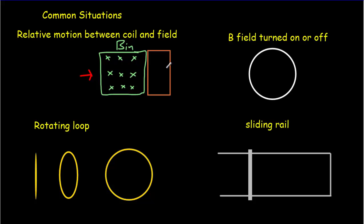How big the EMF is depends on how quickly the coil moves through — if it moves through quickly, you'll get bigger EMFs; if slowly, you'll get smaller EMFs. Another scenario: you have a loop and suddenly turn on the magnetic field into the board. You'd suddenly get an increase in the number of field lines through that loop — very sudden — and you should generate a large but very brief EMF in that loop.